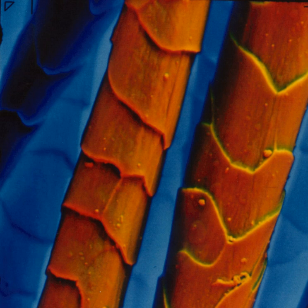The characteristic elemental X-rays produced also in the ESEM can be detected by the same detectors used in the SEM. However, there is an additional complexity arising from the X-rays produced from the electron skirt. These X-rays come from a larger area than in SEM and the spatial resolution is significantly reduced, since the X-ray signals cannot be simply separated from the probe interaction volume. However, various schemes have been proposed to solve this problem. These methods involve spot masking, or the extrapolation technique by varying the pressure and calibrating out the effects of the skirt, whereby considerable improvement has been achieved.